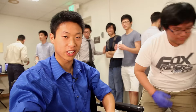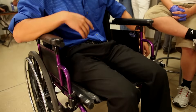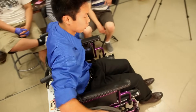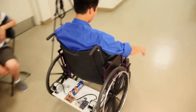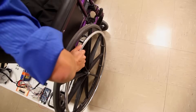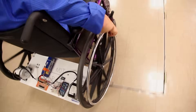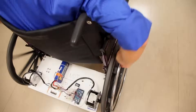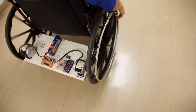Our project is a power-assisted wheelchair. The idea is basically to reduce the load on the average wheelchair user. When I push forward, it'll push forward and give a boost as well — if I go slowly it won't do much, and if I give a bigger push it turns on. We have encoders that read the position and translate that into acceleration, so the motors turn on when we reach a certain velocity and acceleration.